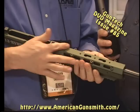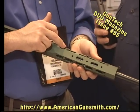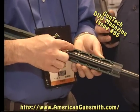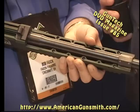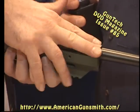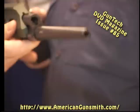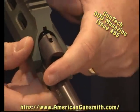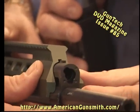On the bottom of the lower, we have a forearm with six screws that hold it on. All six screws go into an aircraft-grade helicoil in the aluminum so it doesn't strip out. It also has four pins for alignment. When you bolt this rail onto the gas block, the gas block is about seven thousandths higher than the housing, so it spring-loads and keeps this in place. There are three keyways that align the barrel trunnion or gas block to the upper receiver. Let's just slide that into place — I can see all three right here: one, two, three cutouts on the receiver. That holds the barrel in place.